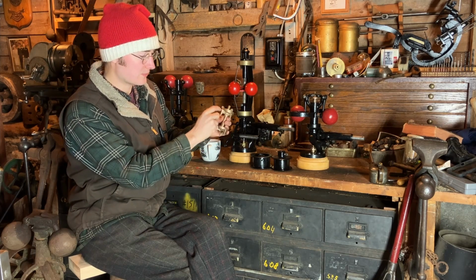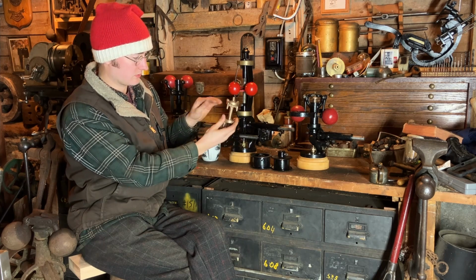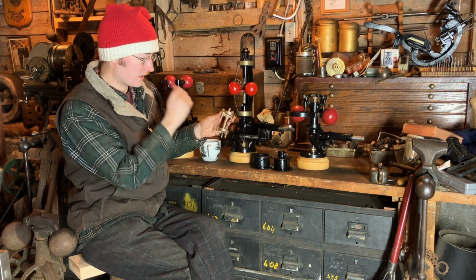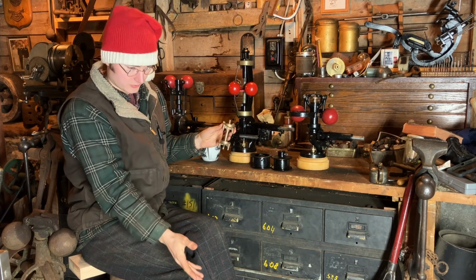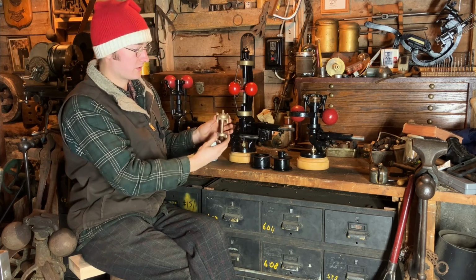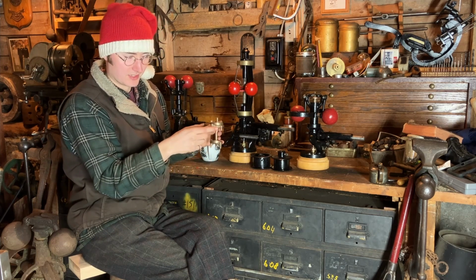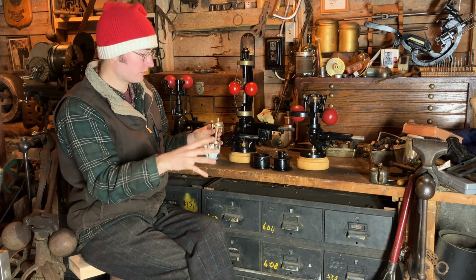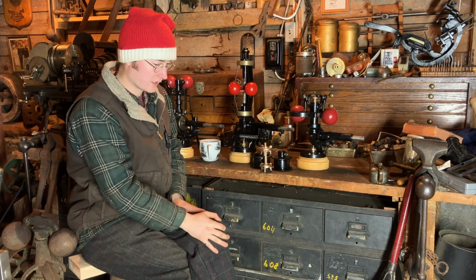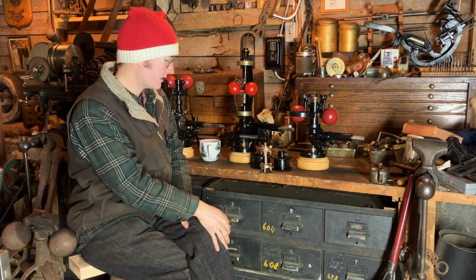If there is no taper, you're going to have a hard shutoff. It will pass, and then it will close all steam to the engine. That will cause the engine to slow down or stop. The governor will go in, and this thing will open again. So in a cycle of that, you're going to have the engine slow, fast, slow, fast, slow, fast, and that's without any load on it at all. So you don't want that. You want your engine to be running consistently. That's why these things are designed this way.